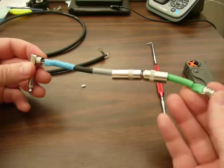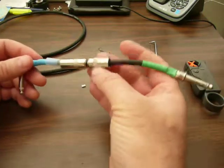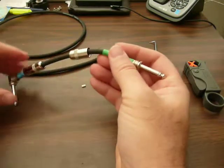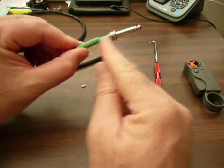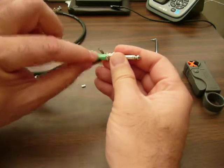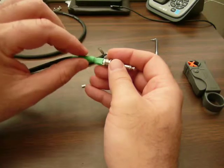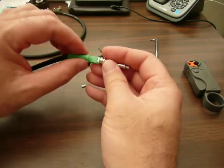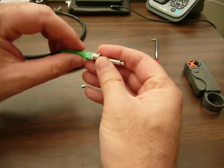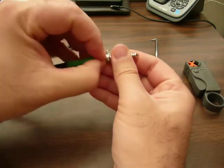What I have here is a section of patch cable that I made, and I have two different kinds of connectors on it. One is the small mini connector, which is very short. These particular connectors do not have a mechanical clamp to the actual conductor, which means the stress on this connection is very sensitive to being pulled out. So what I have done is, after soldering these in, applied some heat shrink tubing and shrunk that down extremely tightly so that it provides that mechanical grip.